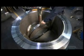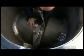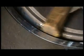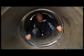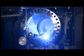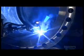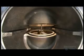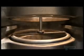A seat ring helps ensure a precision fit with the wedge. The ring fits into the grooved body cavity, then the technician sets another seat ring in place. Before the wedge goes in, a semi-automatic welding machine welds the two seat rings into place using a rotating positioner. Then a lapping machine inserted into the valve body polishes each seat ring to guarantee their finish is flat and smooth.